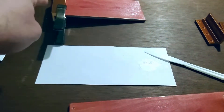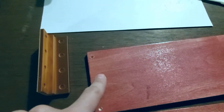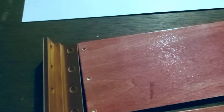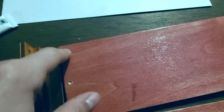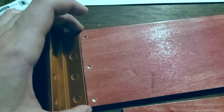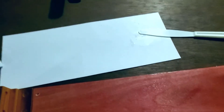While that epoxy hardens up I'll give it 15 minutes. I just want to show what I'm doing to the actual corners — these faces are going to be touching one another, so I'm drilling shallow holes to give it a little more grip. When the epoxy oozes in it will get into those holes and hopefully soak into the wood a little bit, giving it a more aggressive hold. You can see there's a little epoxy in that crevice there — it oozed out, which is hopefully a good sign there was enough. I know there probably wasn't, but we'll watch this and move forward once it hardens.